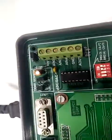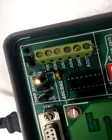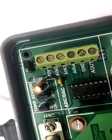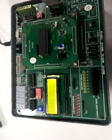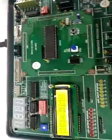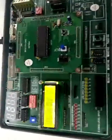To check the DAC output, here in this program we have programmed the DAC to give ramp output, and to check that, connect CRO or DSO channel at A out and ground to ground and see the waveform, and in the same way we can perform experiments for other peripheral given on this trainer, and the code is given for that in that CD.